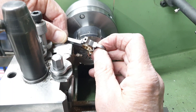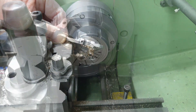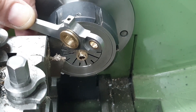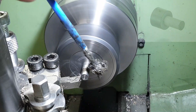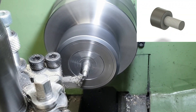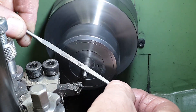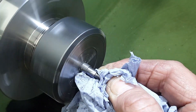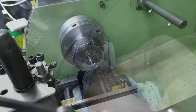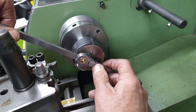It's not really visible in the video but the bush is slightly thicker than the actual coupling rod, which is important because it's the bush that needs to be making contact with the moving surfaces on the trailing coupling rod. The knuckle joint pins are also an easy turning exercise. I used some 6mm silver steel bar, turned down a shoulder for about 6mm and threaded that out at 4BA, and before removing it from the chuck I did a quick test fit with one set of coupling rods, then cut it to length and faced off the other end.